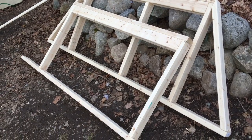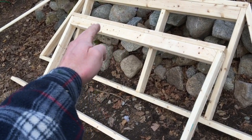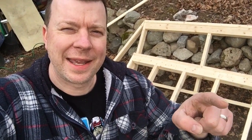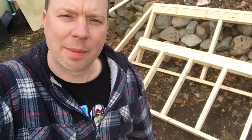I want some kind of membrane to get the water to flow around it if possible. Working on the back wall right now — I can put a ton of studs in there, probably 16 on center. Fast forward through the magic of cinema — there's five studs all in all, actually under 16 inches on center, which I think should work pretty well. I might put some dead men in, which you use in retaining walls to help a wall from caving — that might be part of the plans.